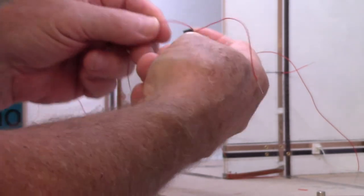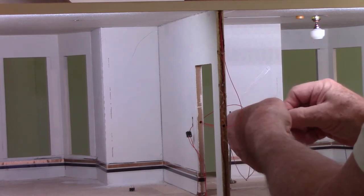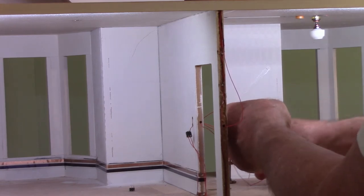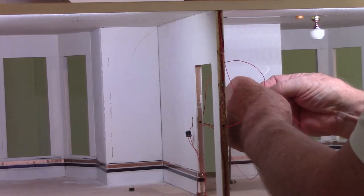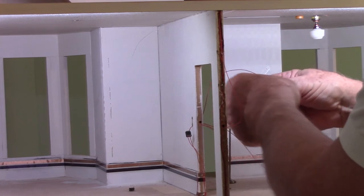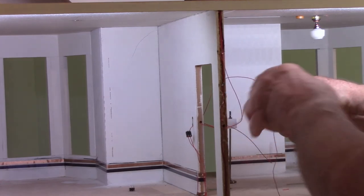Find the common connected wire, and we want to put both of them so that I can pull them through the hole together. I'll start with this one. I'm just going to wrap it so it's coming that direction, and we'll take the other side of the tail, and then I'll take the other one because we're pulling from this way. I want to tie them in a straight line, or as straight of a line as I can, so that they don't interfere with each other in the knots. Doing a single one is a lot easier than trying to do two together.